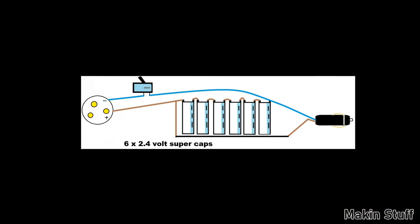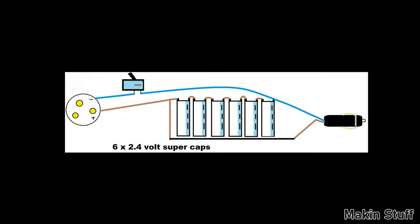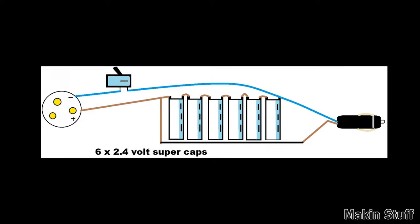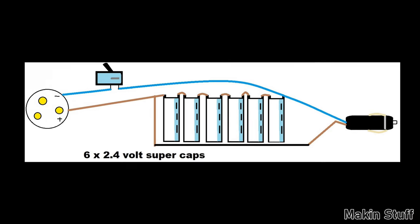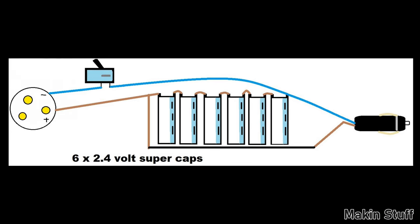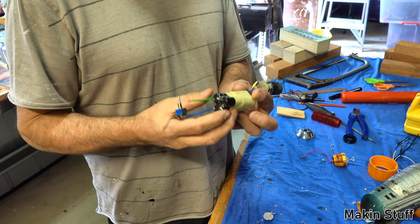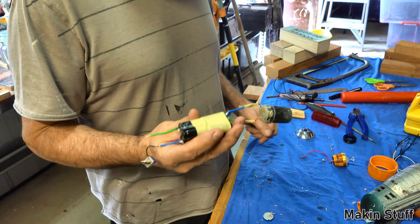So here they are, my six supercapacitors wired in series. They're 2.4 volts each, six of them rated at 14.4 volts, so that will easily charge up to 12 volts without overloading. And I have a switch and an LED light in between that, and the cigarette plug is used to charge it up. So I've already charged these supercapacitors with my auxiliary battery that I've got there, and how I do that is